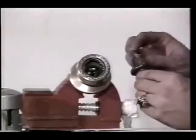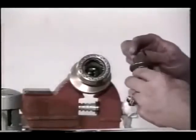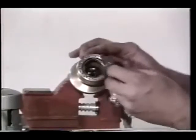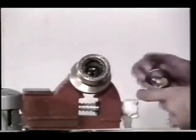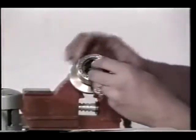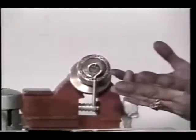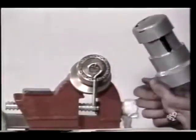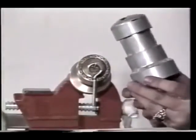So in a few seconds, you have attacked and successfully removed the working parts for the most popular lock in the world. Hasn't damaged the cylinder. We still have the clips. You can see the clips that hold it. We can put it back in the lock. More importantly, we can stick a screwdriver in, turn the lock mechanism, and open the door.